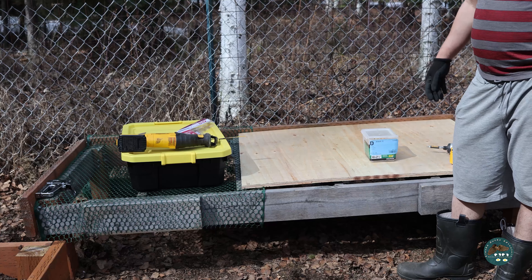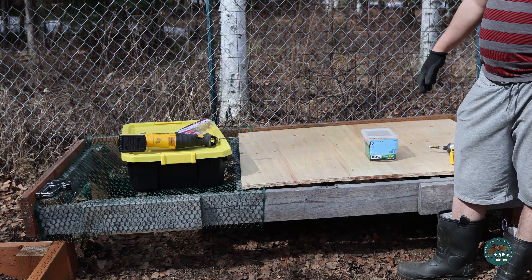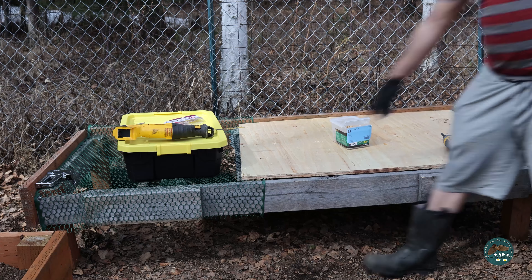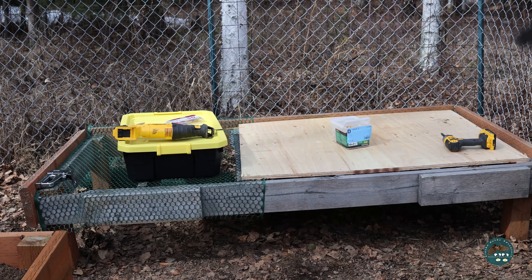Let's add some two and a half inch screws to secure the bottom wood where their bedding is going to be. I got it all screwed down on the edges and the center. I went in on an angle on the corner because it's way too close and started splitting, but it's not going to go anywhere — I stepped on it and it's pretty sturdy. Next, we're going to add a protective layer to their sleeping area. I got this white wall panel — it's 100% waterproof, you can paint it, and it's supposed to resist mold. It's going to be an added protective layer for the duck bed area and makes it easy to clean.